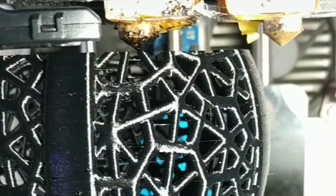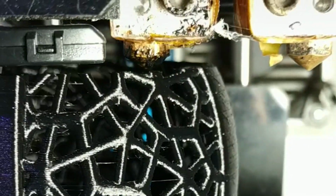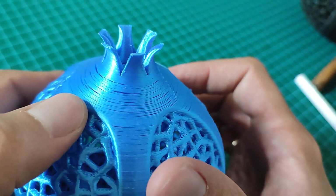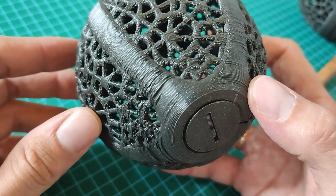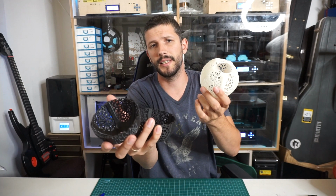As far as making them on the 3D printers, the shape is very complex and the extruder needs to jump from one shape to another. You can see it has hundreds of tiny holes or shafts, whatever you want to call it, which causes some quality issues. So I tried to print it colder, but then the layers don't really adhere. The bottom part gets smushed, so basically it messes up a bunch of times. And sometimes they even fail completely.